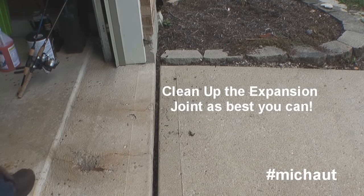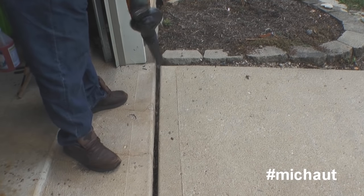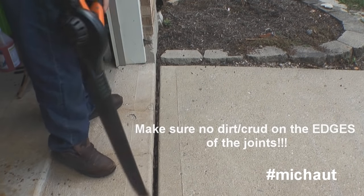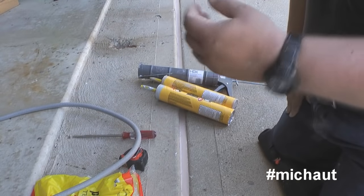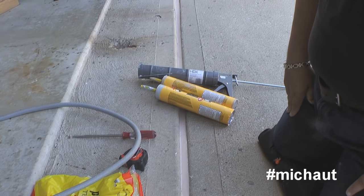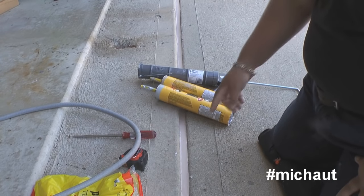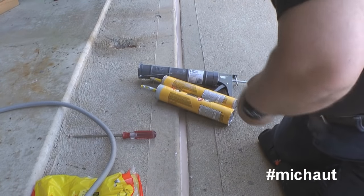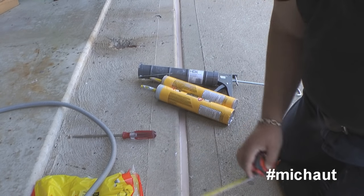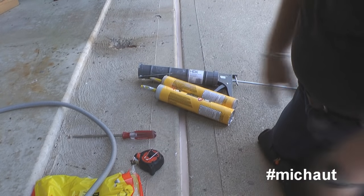It's pretty simple. The other formats out there to fill in expansion joints are: you can use asphalt and little stone, you can use this kind of board that you can stick in there that's made out of some kind of tar paper, there's wood, and a few other formats. But all of them are designed for a specific size of expansion joint, which this would qualify because it's basically about an inch, give or take, depending on where the expansion joint is — because after 10 years these have changed sizes overall.